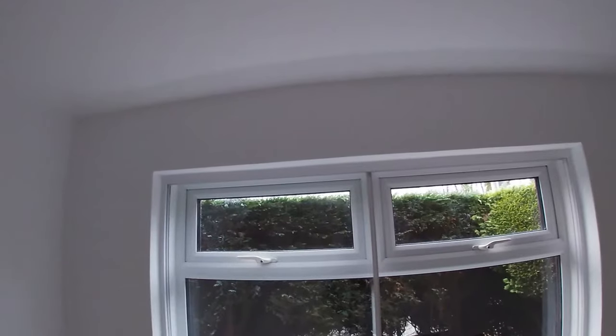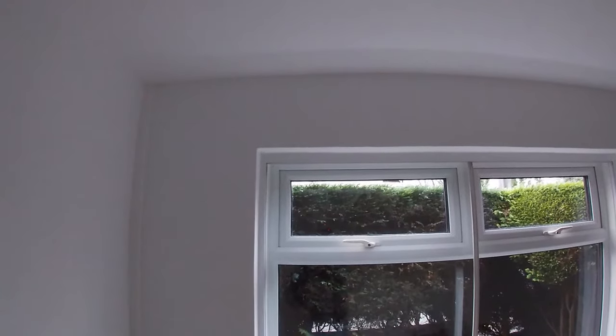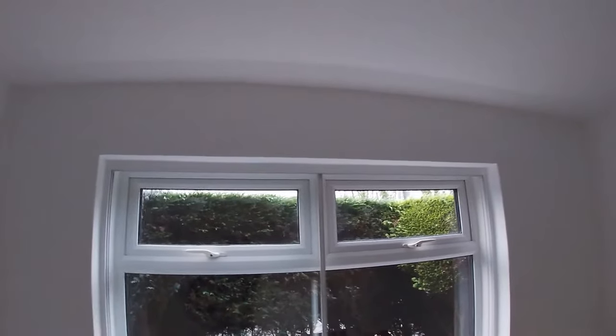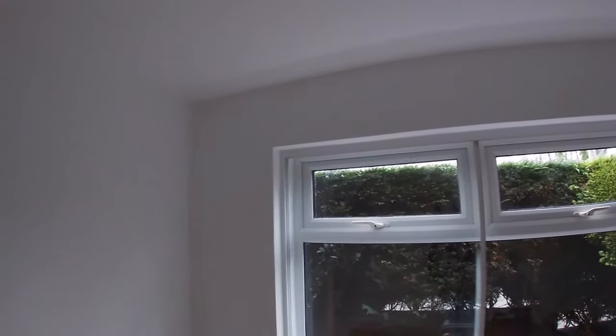Another reason is if I'm drilling the holes for the curtain pole and I do hit problems, it's going to make a little bit of mess. I'm going to have to refill them, re-drill them. Whereas with the timber batten method, I can actually adjust the holes on the timber and re-drill those and fill the holes, and it won't be seen. It's a much easier job.